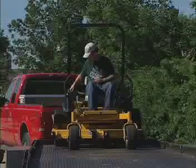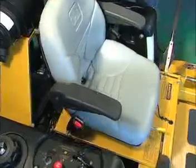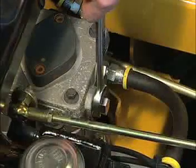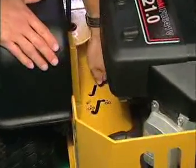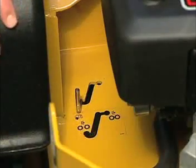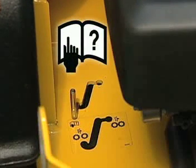If you're moving a tractor with an inoperative engine, the bypass valves on the hydraulic pumps or transmissions will need to be opened. Opening and closing the bypass valves will vary from one machine to another. Refer to the owner's manual for additional detailed information.